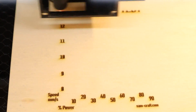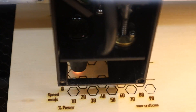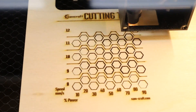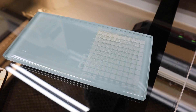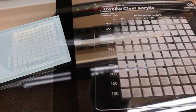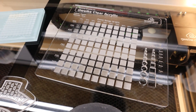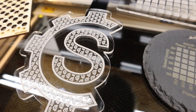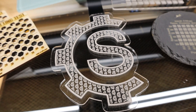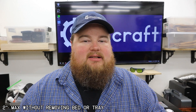So basically my two learning curves were Z-height focusing and engraving being smaller than the cut area — not too bad. As far as material tests and real-life uses, I've really only been using this machine to cut Baltic birch plywood, batching out wood production items for products I'll soon launch on my website. I tried engraving slate and that worked as expected, but I use my xTool for engraving. I also have concerns about putting anything tall like drinkware in this machine, given its maximum Z-height work area of only 2 inches. It definitely seems set up for flat work like wood or thin objects.